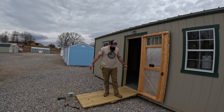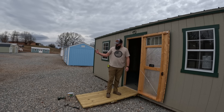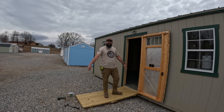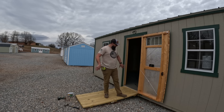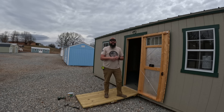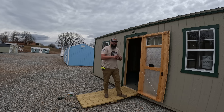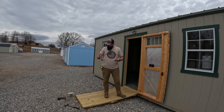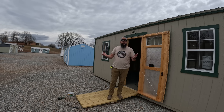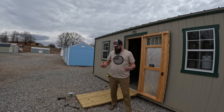There you go — that's the ramps installed. I'm 6'4", 260 pounds, so these are pretty stout holding me up. What did we use? Pressure-treated 2x6 and pressure-treated 2x4. The ramps are 72 inches long. We used a 25-degree end cut to give a bevel on each end. Number 10, 3-inch deck screws with the T25 Torx bit — they countersink and are self-tapping, and will go through light metal. We used a 2-foot level, impact gun, speed square, tape measure, pencil, and circular saw.